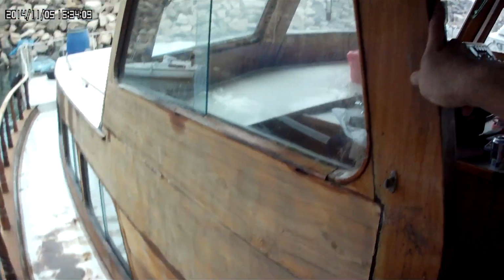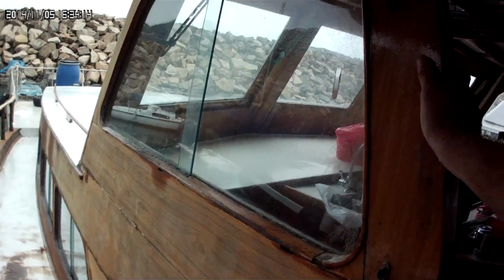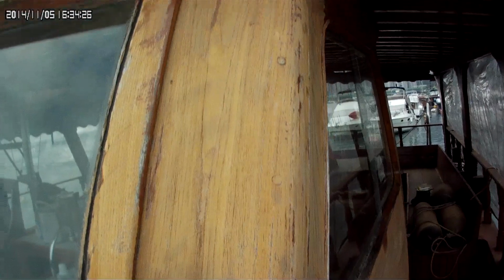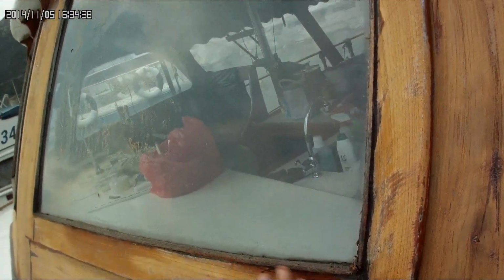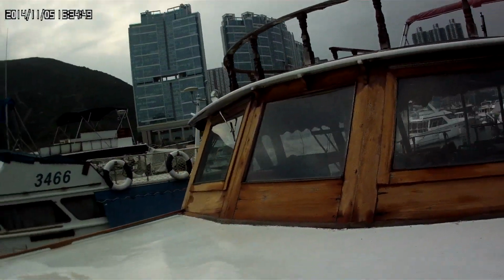But it's looking good. I do not have as much neglect on these walls as I had before, so it's very minimal. And again, it's just a nice orange. That's just done with 40 grit to get off the majority of the varnish. You can see with just 40 grit how we got all the lines there. But if I go over with 60, then an 80, 100, and then the final 150, she is smooth as a baby's bottom. And seal this all up.